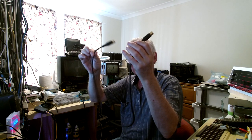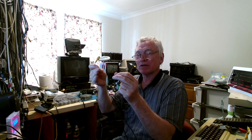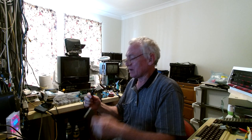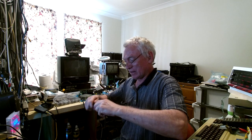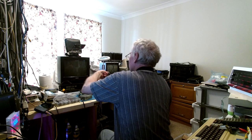G'day. This is what we now have: a male 5-pin MIDI cable, which is totally unmodified, and a female 5-pin DIN connector which now has an RCA for video and an RCA for audio. That can plug into our CRT Trinitron TV monitor. We can just connect the male into the female and there we go — that's our adapter: male 5-pin to RCA for audio and video. Let's connect that to the TI 99/4A.